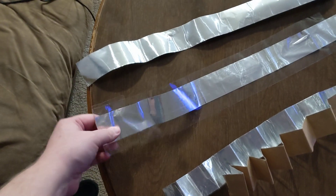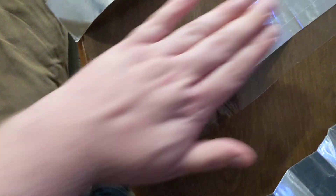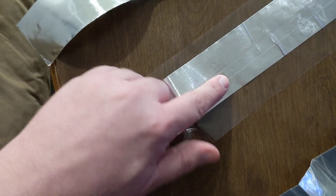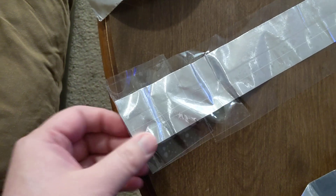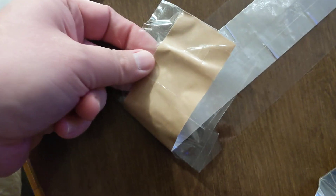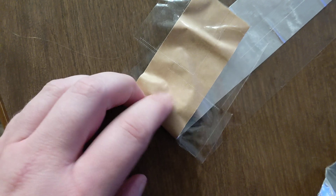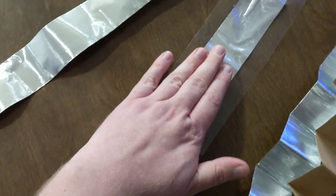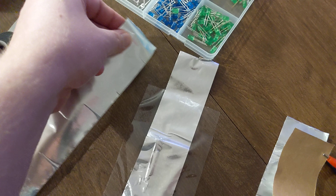The second one is the same length. You're going to cut a piece of scotch tape the same length and cover the aluminum up. On one end, you want it to go down and completely cover the aluminum — make sure there's no aluminum sticking out, you want to overlap. Cover all the way down to one end and go over that end. Cover it up on the other side. Make sure you cover the aluminum all the way up until you get to the end, then keep just a little bit out here, because that's one of your electrodes. So you're going to connect to here and to here.